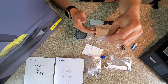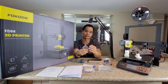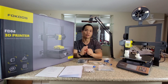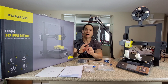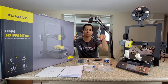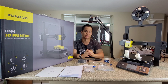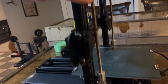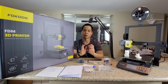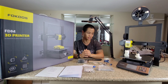You get additional nozzles — these are called V6 nozzles, and a lot of people like this style. Older printers use MK8 style, which some people do not like. This printer is priced at $299, but I will provide an $80 coupon down below, so check out my link — effectively $220. This thing has a double motor Z axis, meaning there are two motors on the Z axis, which allows very smooth up and down movement with no binding. Some printers only have a single motor, which causes binding. I'm glad Focus went with this design.